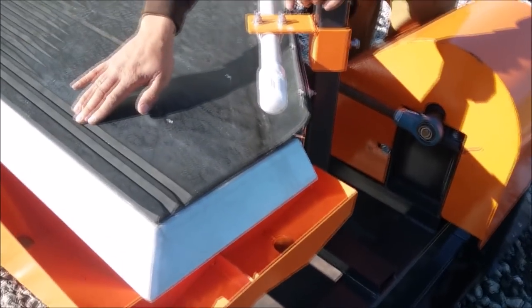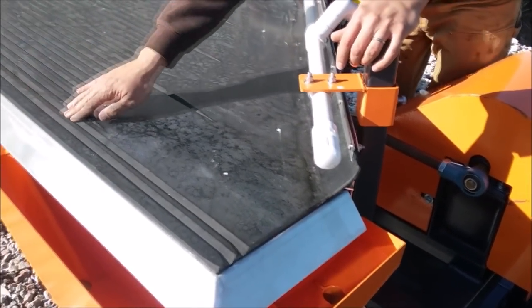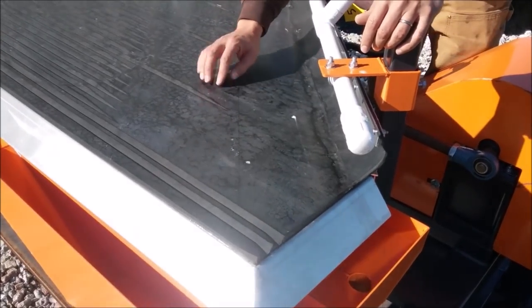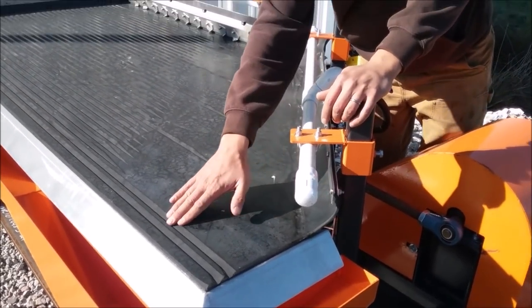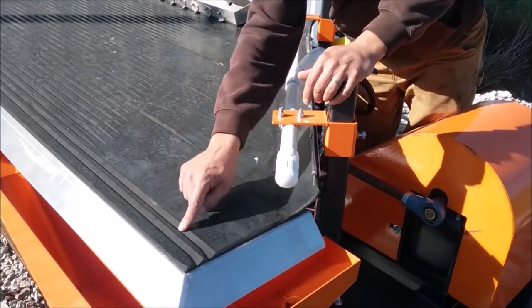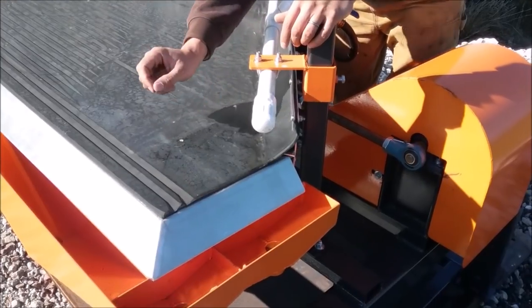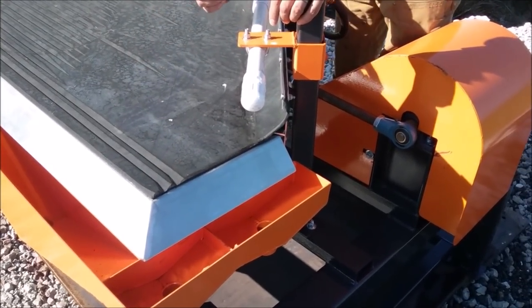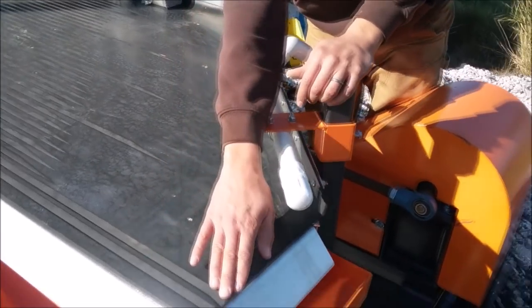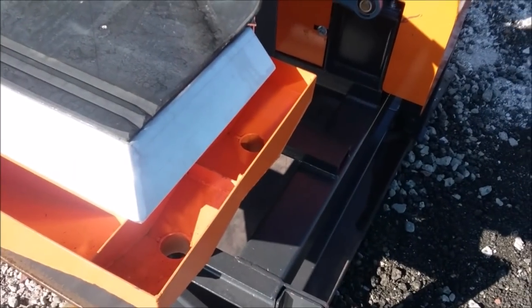At the edge of the shaker table, there are two grooves that run all the way across. These are called our safety grooves. If there is any material that reaches the edge of the shaker table, it's captured by these safety grooves and comes across this way. We've seen some material that's round like spheres sometimes will roll down and be caught by these safety grooves. So that's an important feature of our table as well.